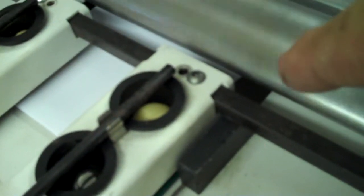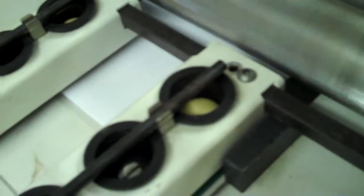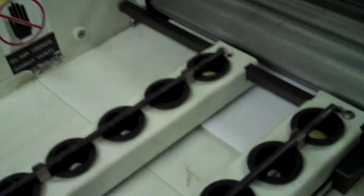To move the wheels in, all you have to do is loosen the set screw on the drive side, which is this one over here, the shaft that drives them, and then remove the clip on this side that holds this roller in position, and the roller will follow the belt and move right over for you and make it possible for you to bring this closer together.